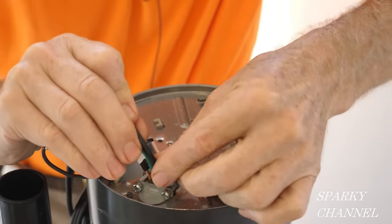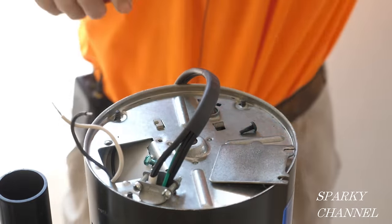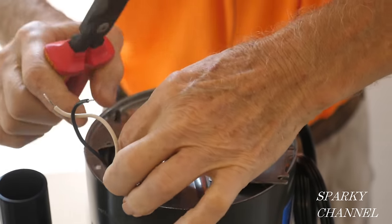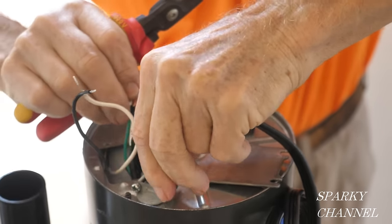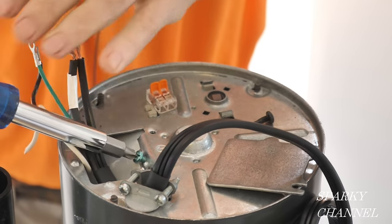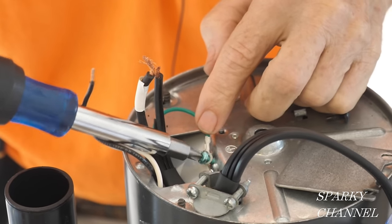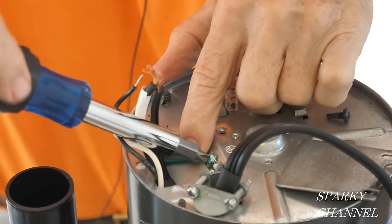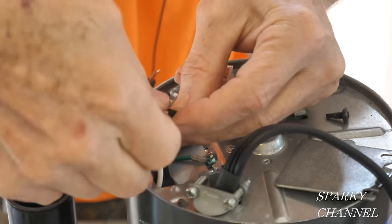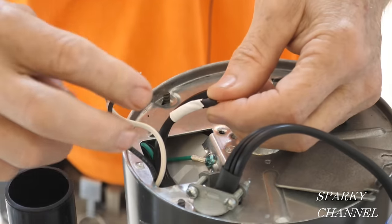Get the wires all together and use the curve. You can use needle-nose pliers to help grab and pull the cord through. The first thing we're going to do is hook up the ground wire — there's a ground screw right here. Take it all the way off and screw the ground wire right into place. Then take the stranded wires and twist them, making sure there are no stray strands anywhere.